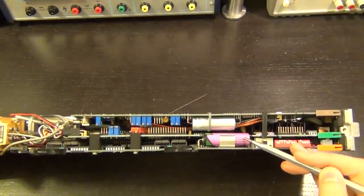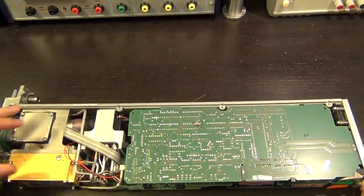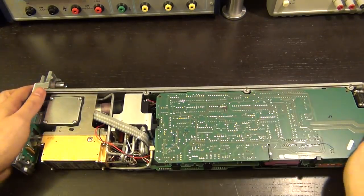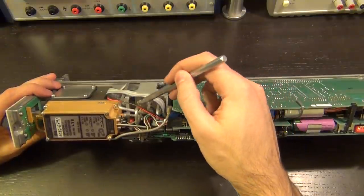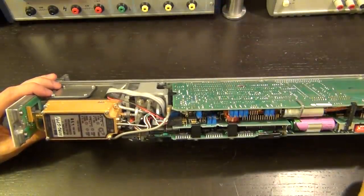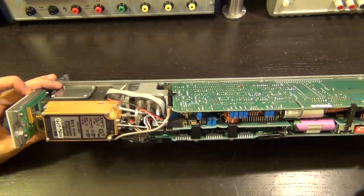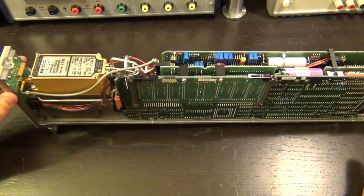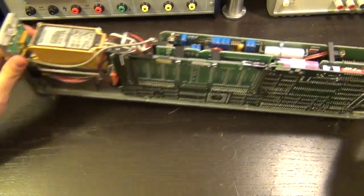There's a battery for data retention and it hasn't leaked at all even though it's quite old — impressive. You have to be careful taking these apart so as not to damage them. Oh, there's another pretty big score — look at that: two microwave relays. Since they're feeding signals up to 26.5 GHz, these are 26.5 GHz microwave relays. They're not solid state, they have very high repeatability and very little insertion loss — really awesome.